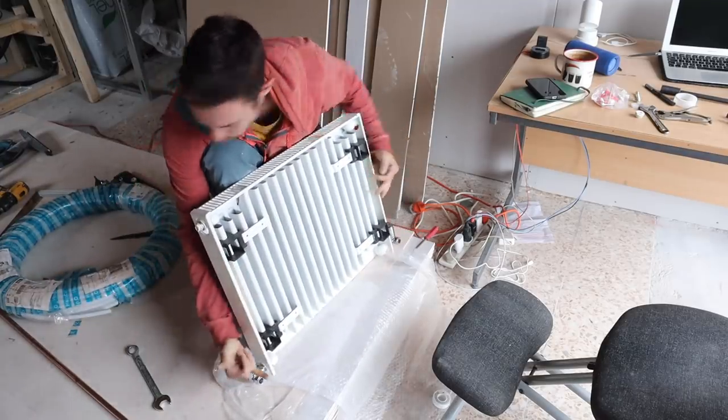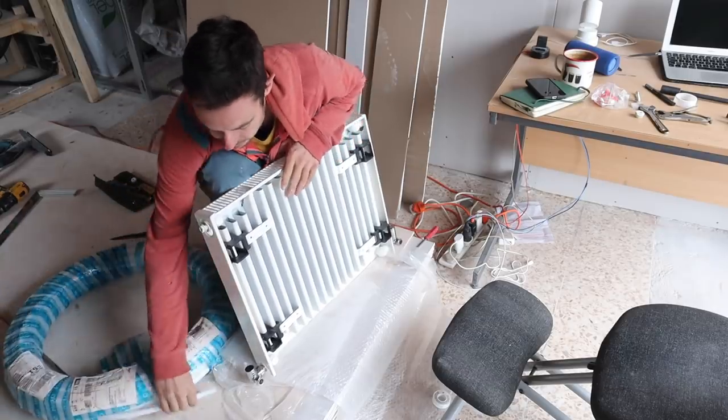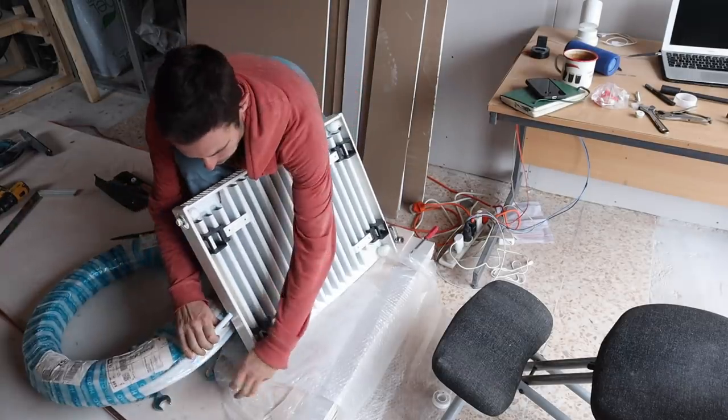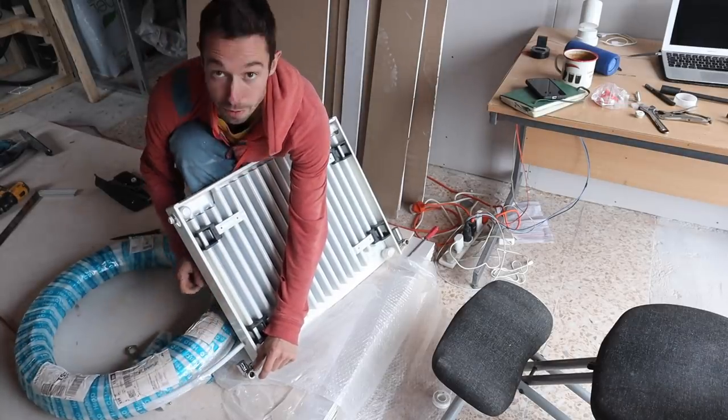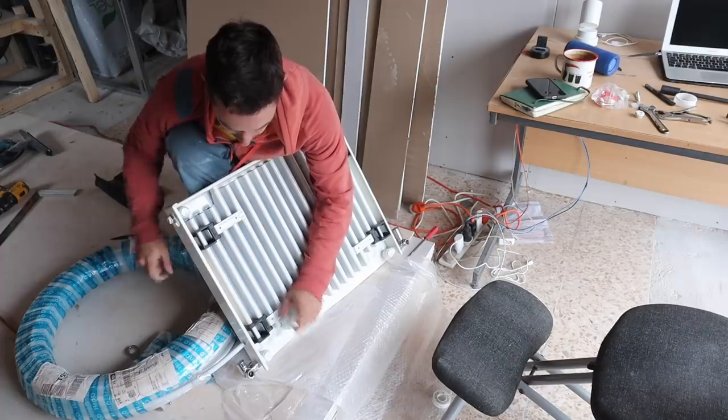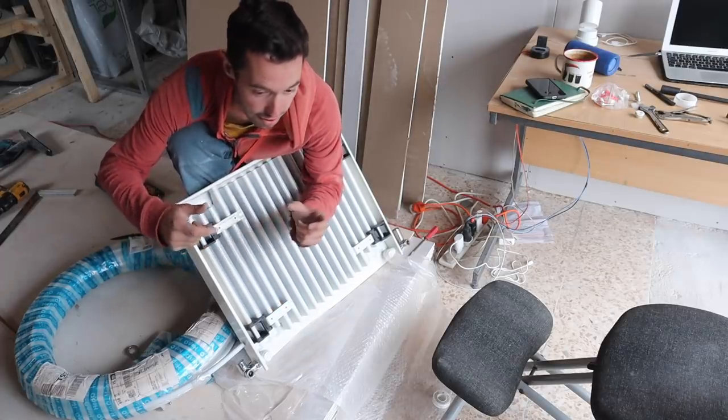I've drilled a couple of holes in my wall. Now I need to see the size it will be from the plastic pipe, which will go in, how much will go through the wall, and how much is needed to go into the joint of my push fit. So see what that is, cut those lengths, and then put it together.